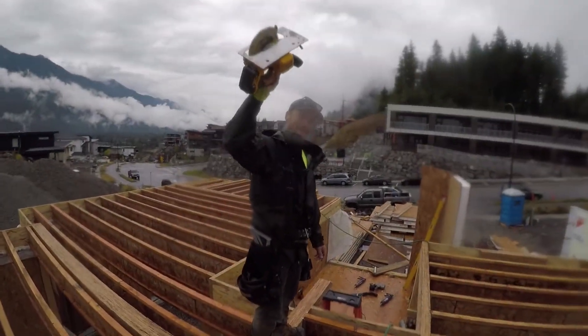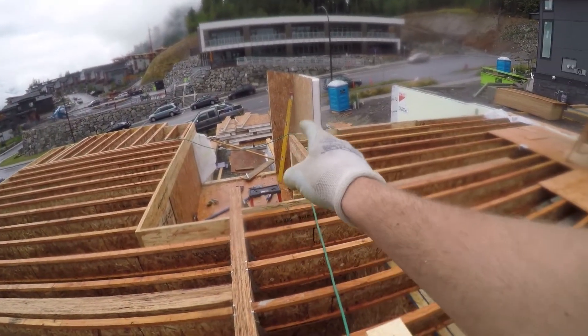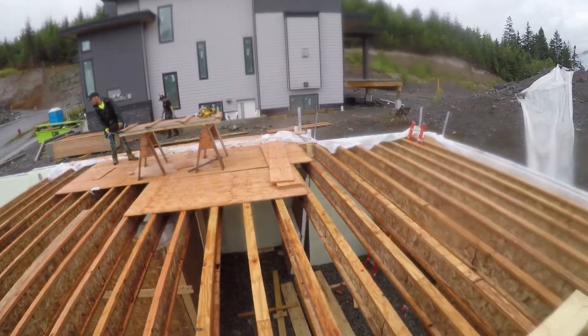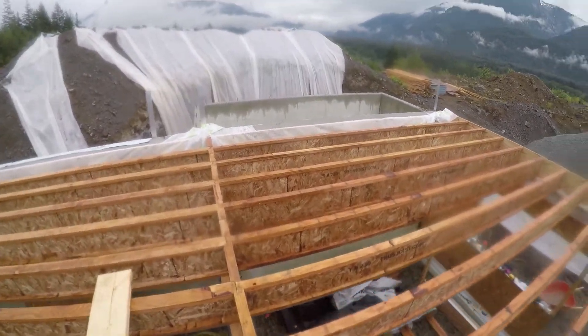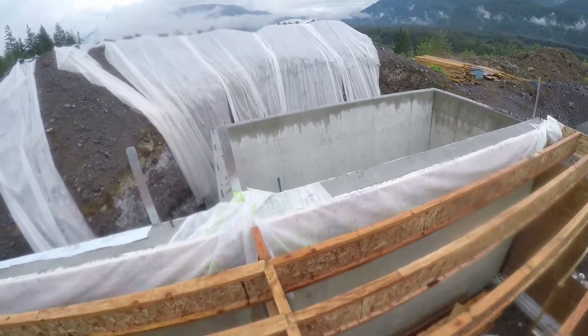So there is a week done. We've got a ton of stuff done this week. Stu and I ran off and did all the rim joists, all the joisting for the little balcony that's going to go at the front. We have the landing in there now with the SIPs started. We have basically the whole main floor done — the garage out there we're going to do later. You can see all the joisting is in. We've got some weird funky blocking — look at this weird blocking detail we have to do, jig around it. And you can see the retaining wall at the back.